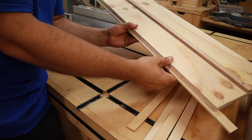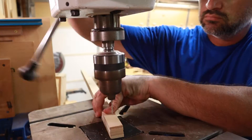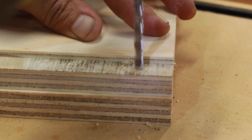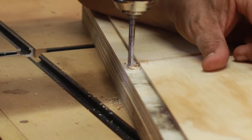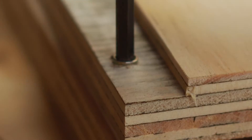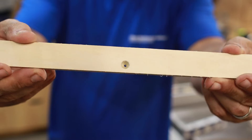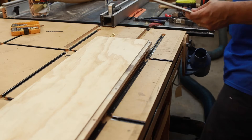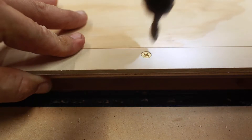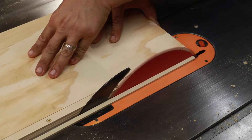The strip is a little wide, but I did that intentionally and I'll slice off the excess in a minute. Since I'm making a few of the inserts at once, I'm using the drill press to drill some holes in all of them at the same time. Now I can use those holes to tap a reference mark in the rabbet and then drill some holes for some threaded inserts. I'm going to install these little 8-32 threaded inserts into the holes I just drilled. Using my smallest Amana countersink bit, I drilled some countersunk holes in the strips where my pilot holes were. And finally, I can secure the zero clearance inserts in place with some fancy brass screws — it was all I had handy in the size I needed, so brass it is. With the insert in place, I can rip off the excess and once again I've got my nice crispy edge.